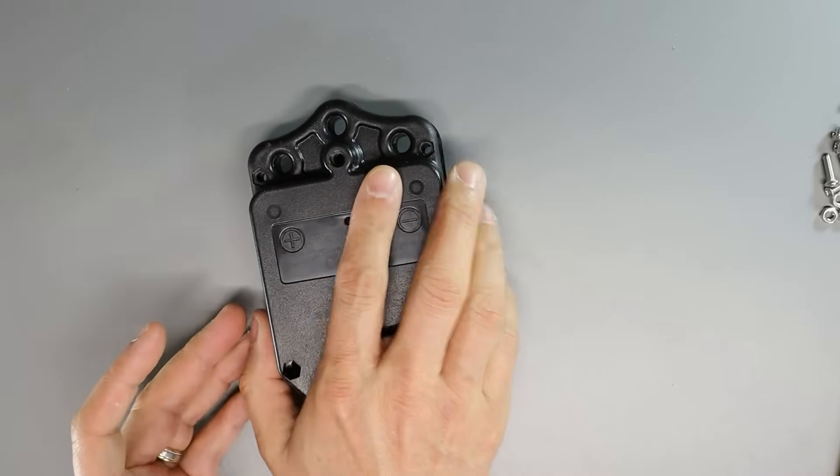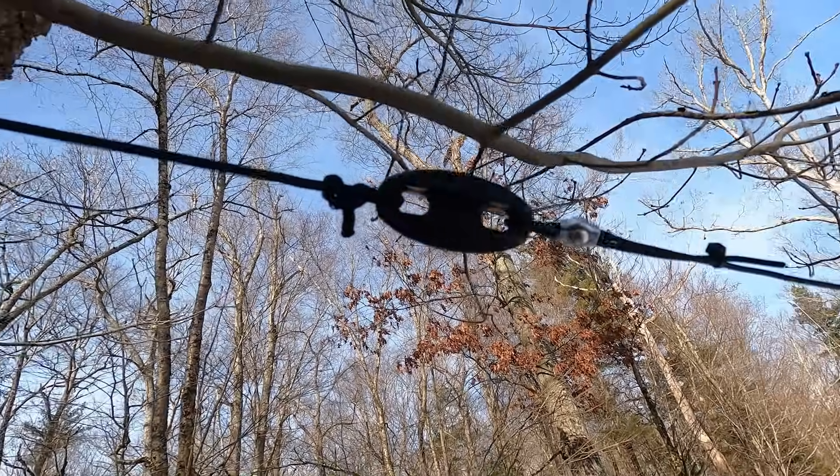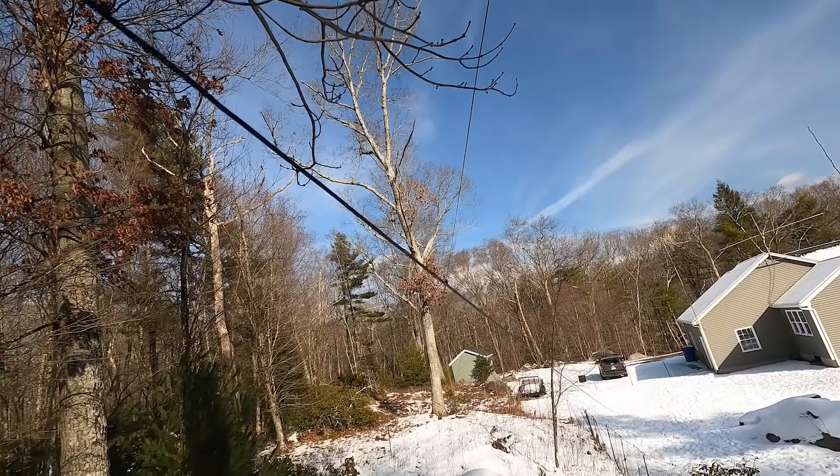Overall this seems like a pretty interesting design, and it looks like this case could be used for multiple configurations. I'm going to put it back together so we can put this antenna back in the air. This antenna may not be the best choice for your average POTA activation where you're going to operate for an hour or two, simply because it takes a lot of effort to set up and you need so much space. It might be a good field day antenna if you've got the room and a couple of friends to help. Because this antenna has a heavy-duty weatherproof Unun and 14-gauge wire, I'd say it's best suited for a permanent home station installation provided you have the room. So if you're looking for an antenna that covers 80 through 10 meters and have the space, this may be one to consider. There will be a link in the video description. 73 for now and thanks for watching.